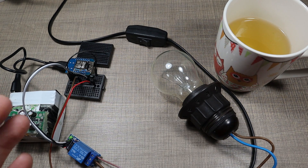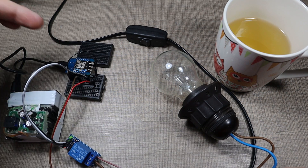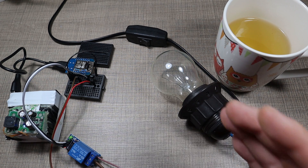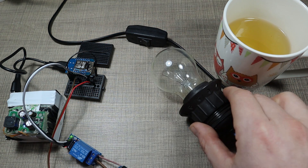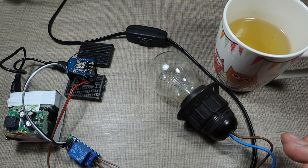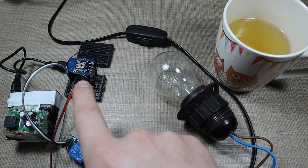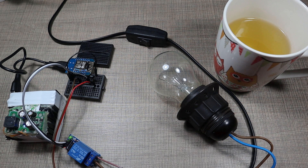Once that water is heated up, the kettle has an automatic action that can turn itself off once the water is boiling. So in the time from when I wake up until I get downstairs to the kitchen to prepare the tea, hopefully the water will be ready. The device is controlled by the WEMOS D1 Mini; it controls a relay that works in normally-closed mode, so for the kettle to operate the relay is basically kept off — it acts as if it's just a regular kettle connected directly to the mains. Once you arm it, that triggers the relay and the device knows it needs to turn on when the exact conditions are met, and those conditions are controlled by Home Assistant.